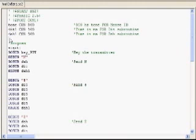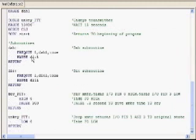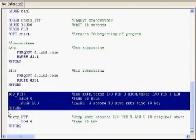When we execute, we're going to go through and key our push to talk. So this go sub statement tells us to go down and run a block of code. This particular one is key PTT for key push to talk. It'll jump down here and execute the code. Right now we're going to raise line 0 to high, and that'll actually light our LED. If you had it hooked up to a radio, you would have a relay in your circuit, and it would actually actuate the relay and key your rig. We'll pause 3/10 of a second to give the transmitter time to key up and continue on.